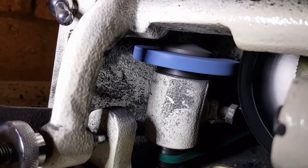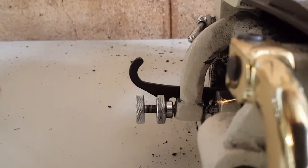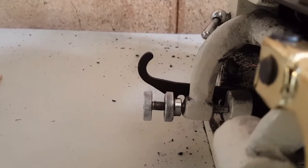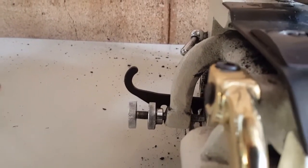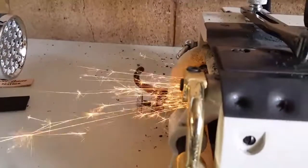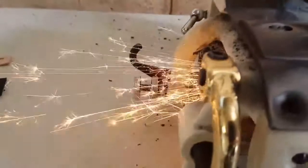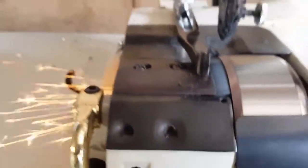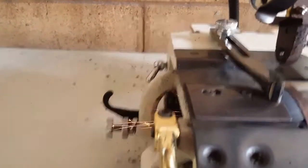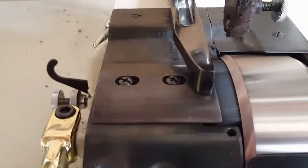Now you see how it's starting to spark. Protruding from the side of the machine is a little bit of spark — this is practically the end amount of spark you want to see at the very end of sharpening. So now you see there's no effect on the ink marks. I'm going to engage more cutting of the roller — now it's pretty bright and a lot of that ink is going away. So when all the ink is gone and all the sparks are gone, we're basically done. This is going to take about five minutes — I'm going to pause right now. We're back, and now you see the sparks are diminished by a great deal. That's the first approach to the cutting, and most of the red pigment is gone from the blade.